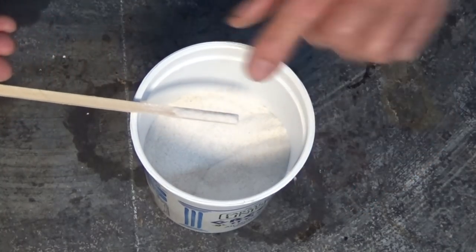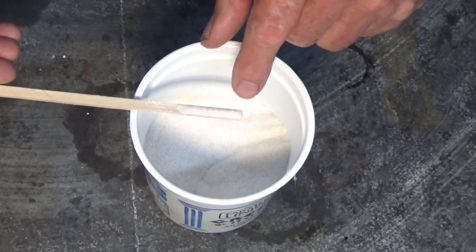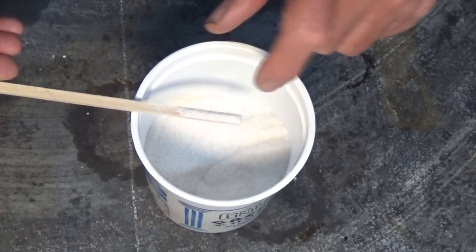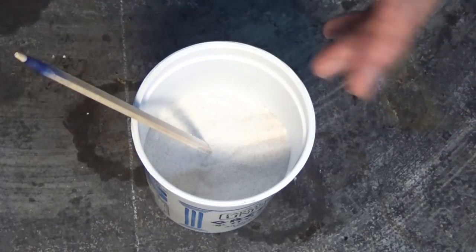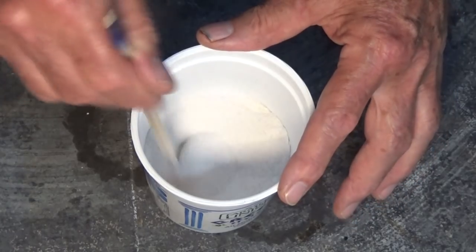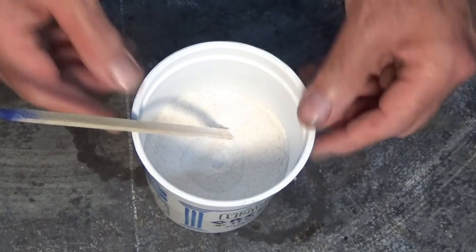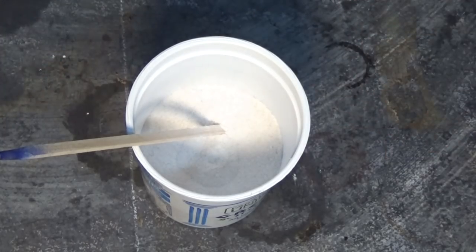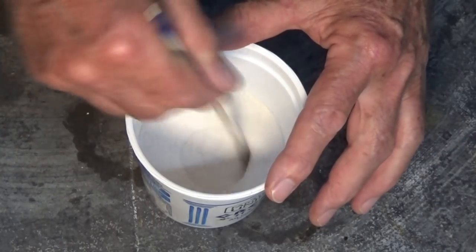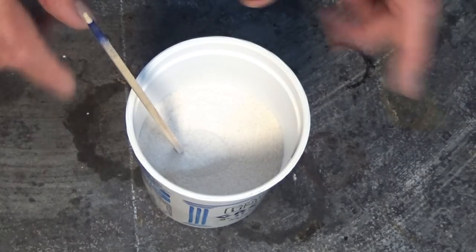By adding the talc, we've got a better chance of filling in some of the air spaces around the sand crystals themselves. Now, I don't know what the ratio could be. Like I said, it's about 10%. And I've got no idea how this is going to play out when we pour the molten metal into the mold. It may just completely burn out, I don't know. But this is all about experimentation, and I'm keen to give it a crack. So let's see how it goes.